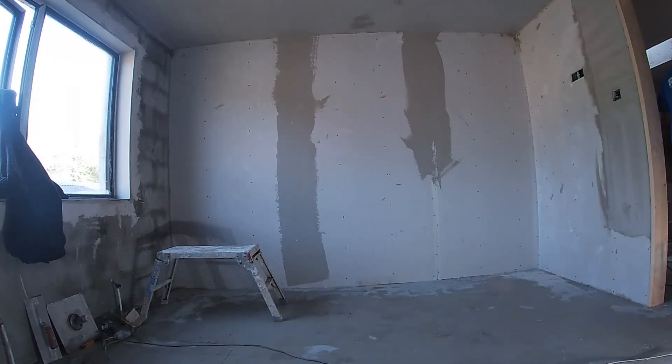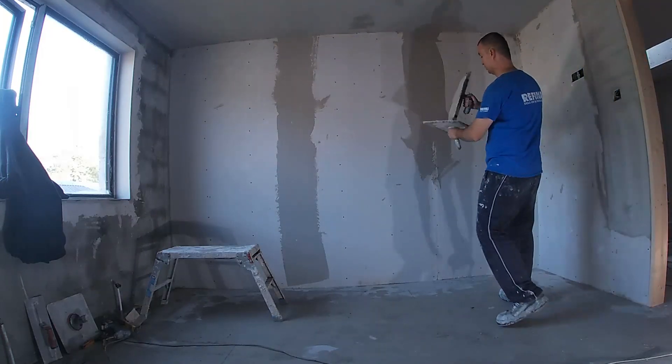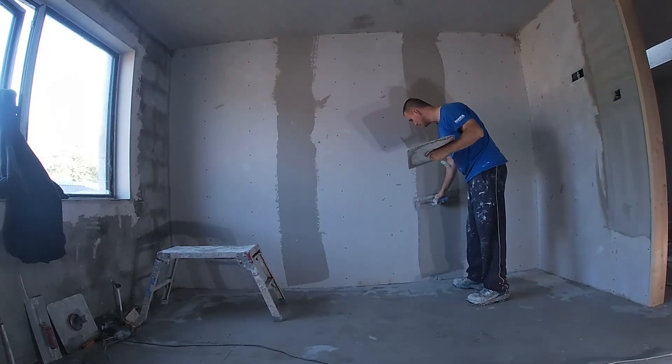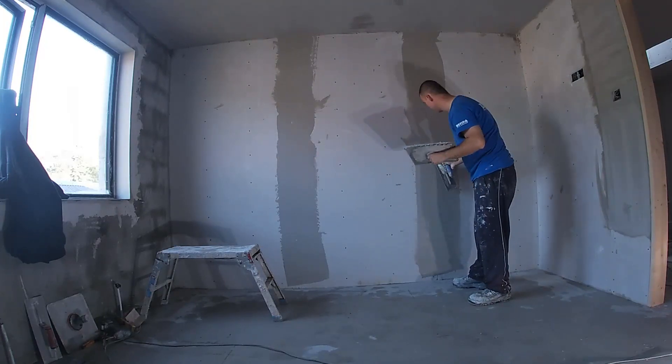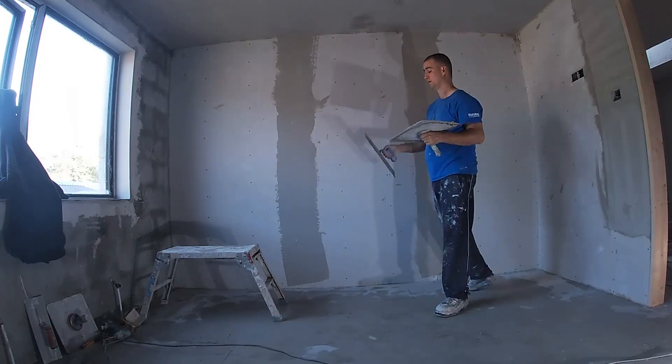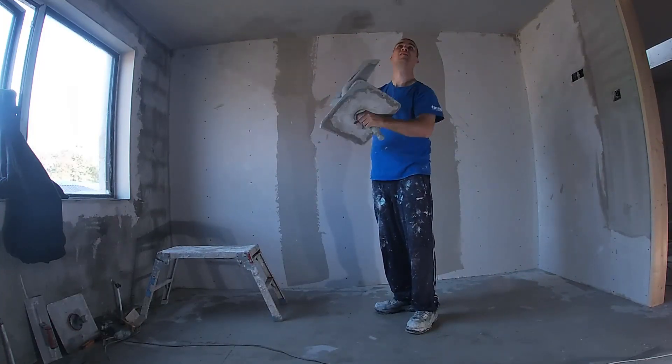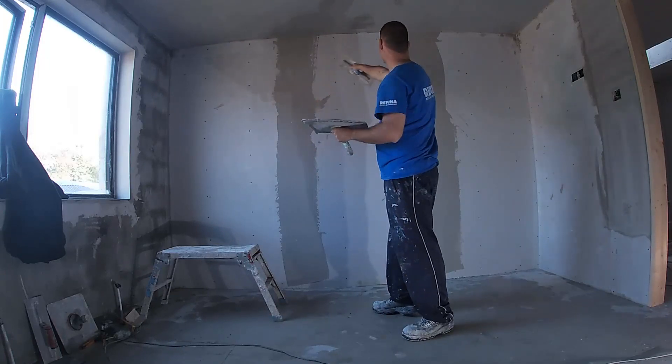It's just as simple as putting a light coat over the scrims. The reason to do that is it helps bury them and makes sure no scrims shine through, as it looks very untidy if even a little bit does shine through — or any bubbles on the scrim. You don't have to do this part; you can skip it and just first coat the whole wall, then second coat, but I do find this helps.